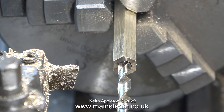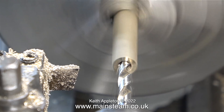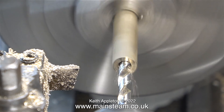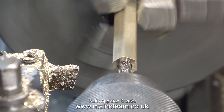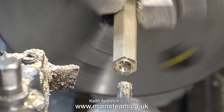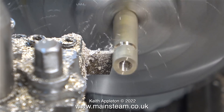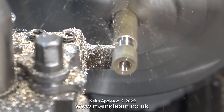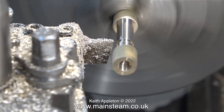I'm only making these adapters in the sizes that are most common: 5/16 by 32 TPI, quarter by 40 TPI, quarter by 32 TPI, and 3/8 by 32 TPI. I always use the manual type of chuck in my tail stock - the type that does not use a chuck key. Because the tap is not held quite as tightly, all that happens is the tap starts to rotate, which tells me it's at the bottom of the hole. Instead of this crude method, you could buy a special gadget that fits in your tail stock chuck, detects when the tap is at the end of the hole and reverses to withdraw it - but I haven't got one of those.